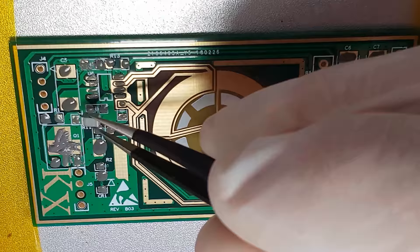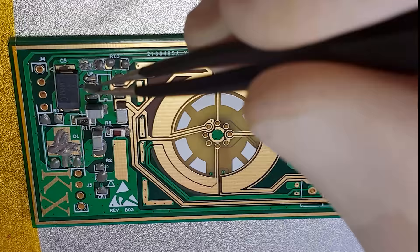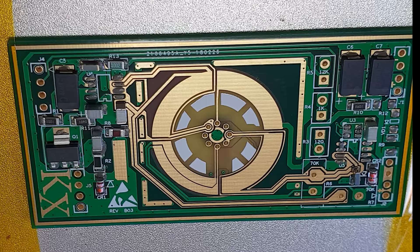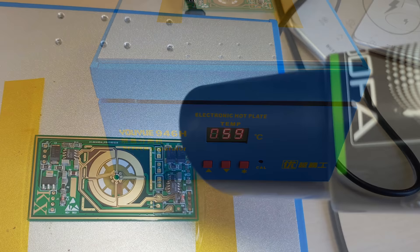Some of these components, especially the SMD film capacitors, are very sensitive to high temperatures. That's why I'm going to use a low melting temperature bismuth solder paste and a screen separation hot plate to reflow everything as gently as possible. There's an entirely separate circuit on the board consisting of temperature sensors that can be used to monitor the most important components without influencing them. The low temperature solder paste is one of the smelliest of its kind, but I am prepared.